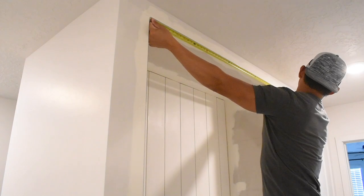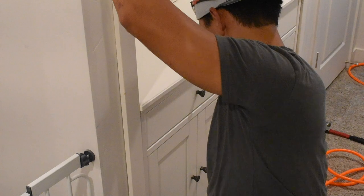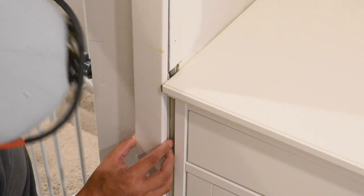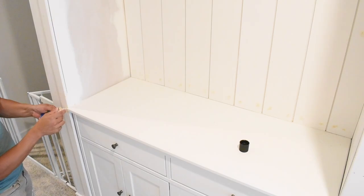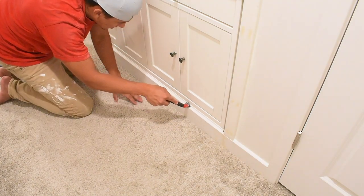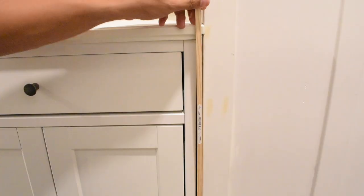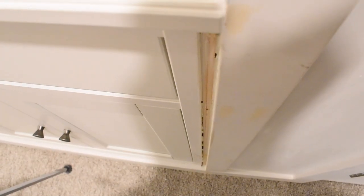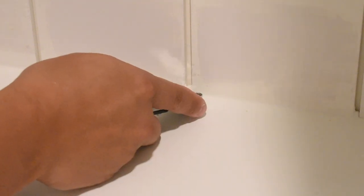Now for molding. I did the top one first — measured the width, cut it, measured the height for the sides, cut those, and nailed them up. When I put up the side molding, there was a little overhang from the cabinet, so I chiseled out a bit of the molding, which allowed everything to be flush again. I'll fill this with mud, wood filler, and maybe caulk it later. Go back and wood-fill your nail holes and any blemishes, wait for it to dry, sand it down, and put caulk all around the molding and around the top, bottom, and sides of the shiplap. Make it smooth with a tool or your finger. I had a gap on the side of the cabinet, measured it, found a square dowel, liquid-nailed it in, and will caulk it later. When caulking shiplap, you may get caulk in the gaps — I didn't want that, so I took a knife and cut it out.